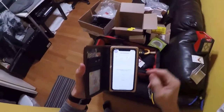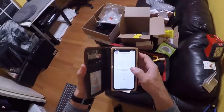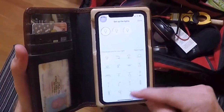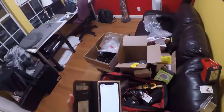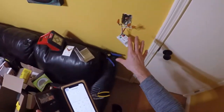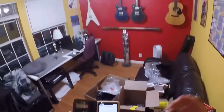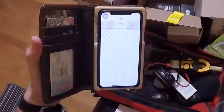The Wiz app has found the light bulbs - we've got all three. Press finish when all your devices have been found. We have to pair the controller separately, so we hit finish. It asks what icon we want - it's hanging from the ceiling so I'll choose this one. You could do this for an entire room. Whatever is connected to this room controller, as long as it comes on in the right sequence when energized, Wiz should be able to pick it up. We've set the icon, hit complete, and we're done.